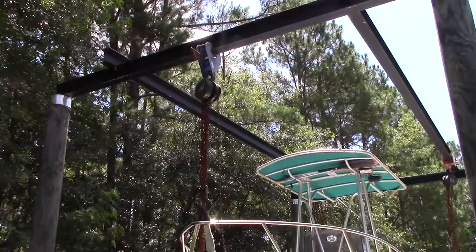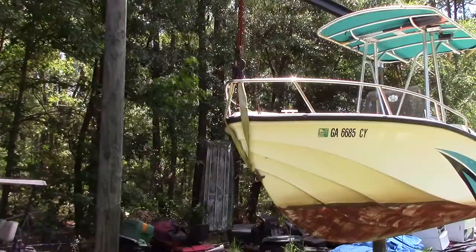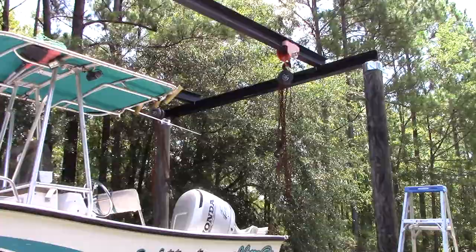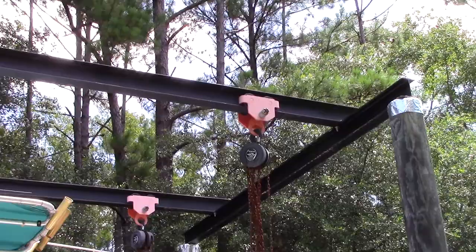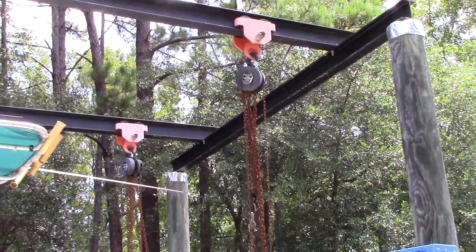There are three lifting points. I have a three-ton chain hoist on the front here, I-beam clamps rated for three tons, and I use a strap to get around the front and back depending on the boat size. We lift several different sized boats — for trailer work or whatever. I have these I-beam trolleys, which are also three-ton rated at each lifting point.